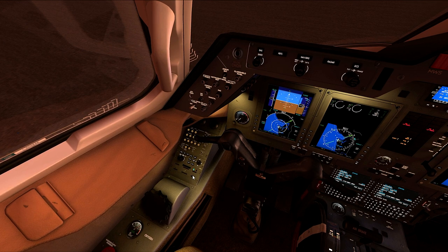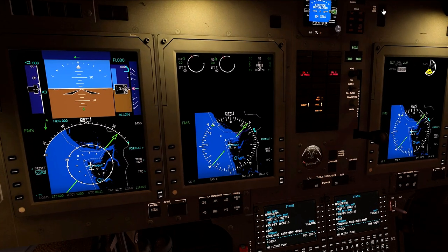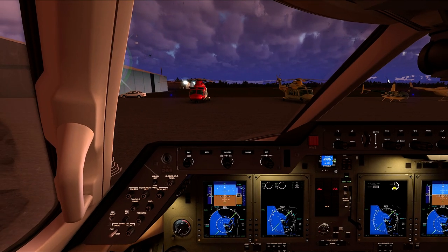There's a test switch right there. The blue light indicates that it passed. And come back down here. The cabin high datum button is not selected, and we don't want that. That basically changes the altitude in the cabin at which we would receive a high altitude warning. When it's not pressed, we're going to get that warning at 9,300 feet or somewhere in that area. And when it is pressed, we'll get it at 14,000 feet.